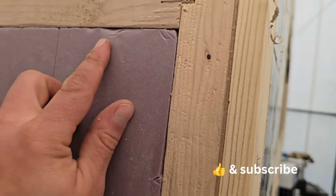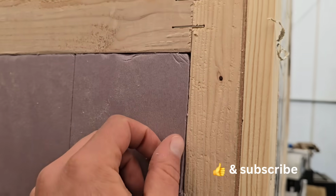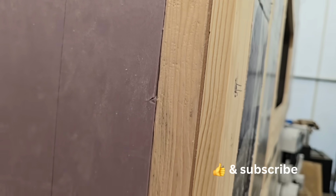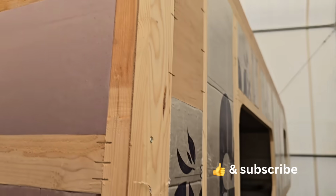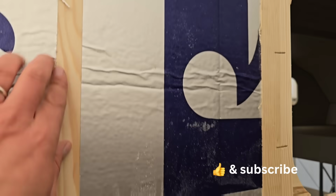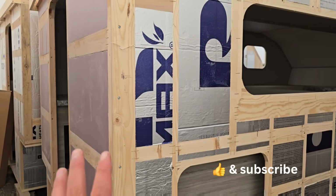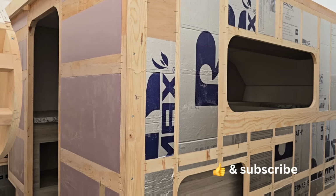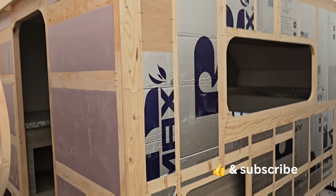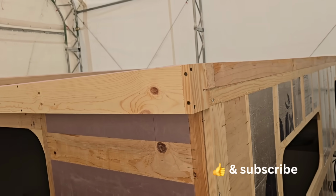You got a little bit of gapping here, but it's hard. It is an illusion on the camera sometimes. This is all tight. It would be very hard for me to get this piece out, right? Everything's tight fit. All of your foam's tight fit. And then because you're using structural foam and it's tight fit, you're picking up structure from that as well, even though it's loose fit into that cavity. And then the roof is the same solid. That's all a SIP up there.